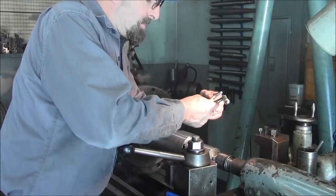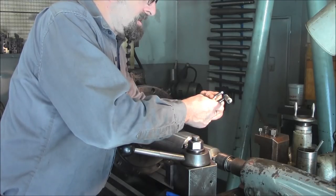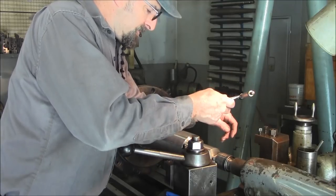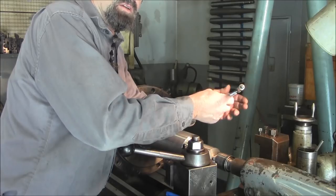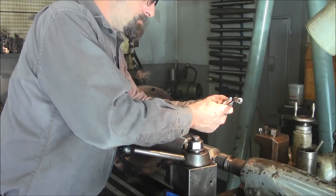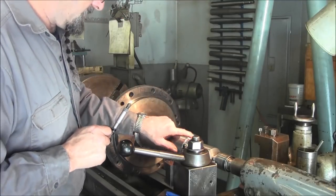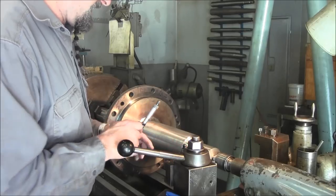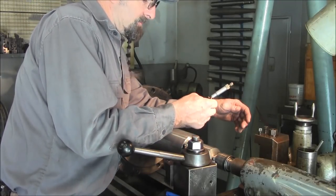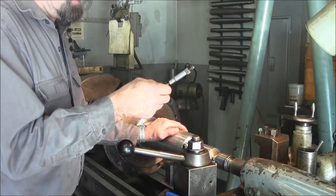We're getting down here close to dimension. The bearings are in and they're going to run one of those over. We're at 2 inches 569 and this is going to be 2 and 7 sixteenths, which would be 2.4375. I measured about 2.3654 or so on the original one — we'll be comparing it when we get close. I'm going to take another cut and show you a little bit of hand roughing, just maneuvering it by hand before we set up the flat pattern maker for the tracer attachment to do the finish radius work.